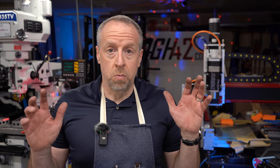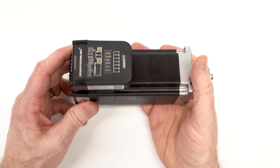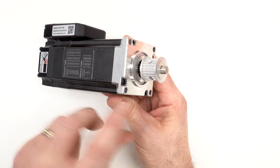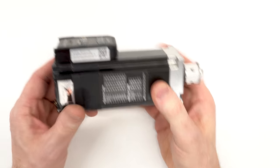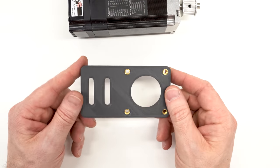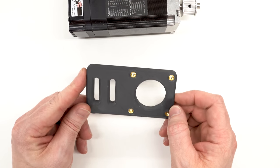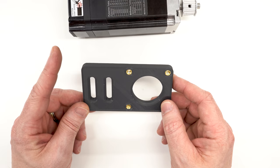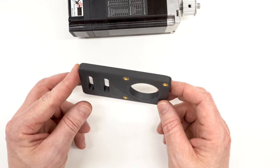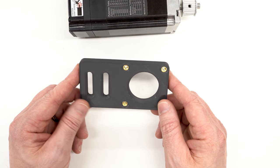So it's finally irritated me enough — we're finally going to fix it today. I've got the servo motor here off of the lathe. This is just a standard NEMA 23 format servo. It just bolts on the front with four M5 screws. In order to mount this in the back of the lathe I'm going to need a motor mount plate. I have one here that I 3D printed out of carbon fiber nylon. If you think you remember that I did this once before, that's because I did. Last time I used Nylon X by Matterhackers, and the plate was just too flexible — under the weight of the motor it sagged and crept.